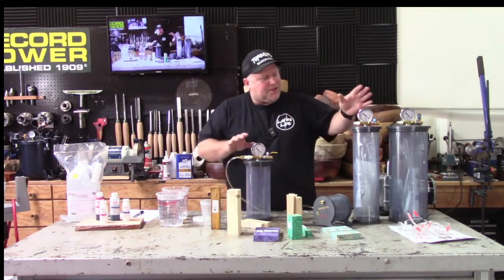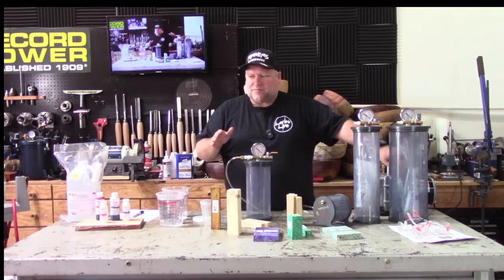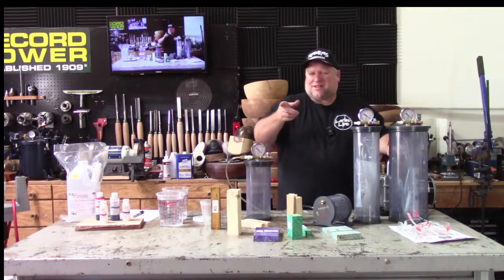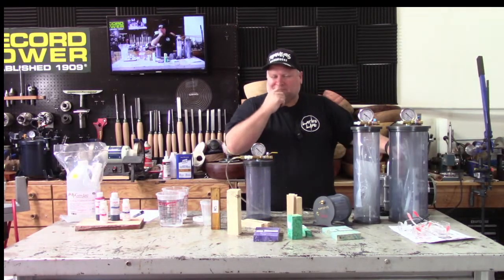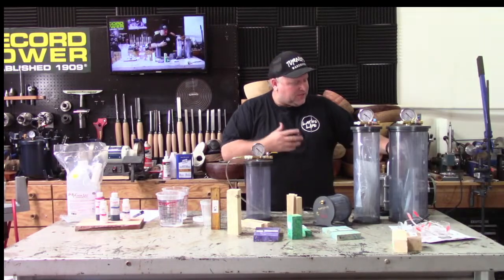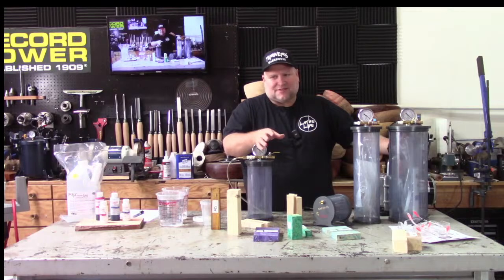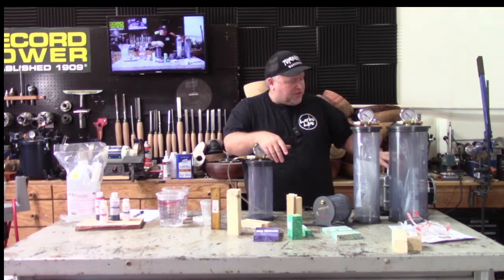But back to it, you need a chamber, you need a vacuum pump. There are a couple of kinds of vacuum pumps out there. You want an oil pump. There's another kind, what's the other kind, Charles? Is it diaphragm or something like that? There's another kind of vacuum pump that doesn't work as well for this. It doesn't pull the vacuum as well. So you want an oil pump, and they are very common in HVAC. So like in Arizona, there's probably a pump for every person at least, maybe more. But you do need a pump.